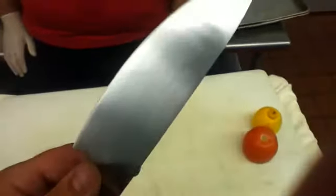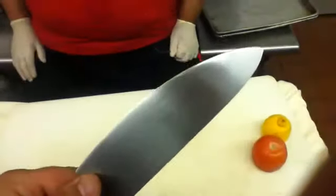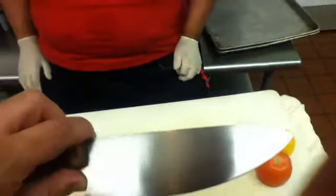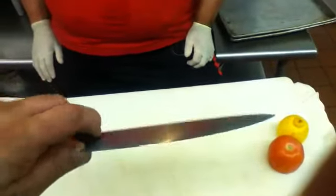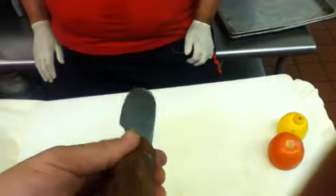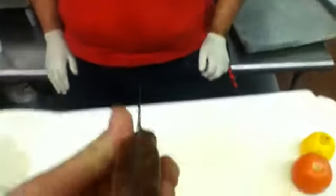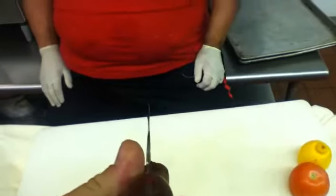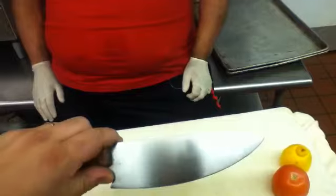That patina is going to go through the whole knife, and this knife is going to end up being a dark blackish color, like the old school chef knives. I made this knife for my father, so that's kind of what he wanted. Also, the edge on this knife, as we've talked about before, is a convex edge. You can see it's kind of a teardrop shape, which is more cleaverish, and he wanted a chef knife that was more like a cleaver.